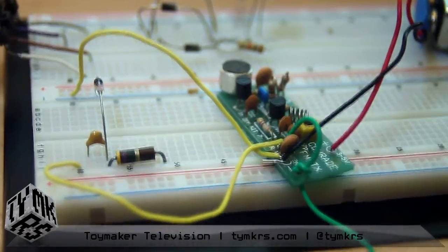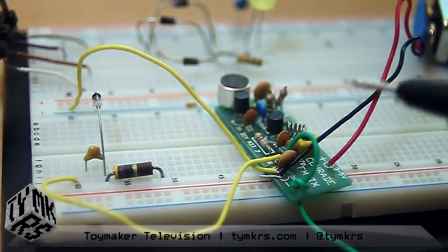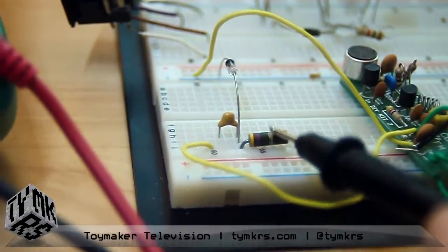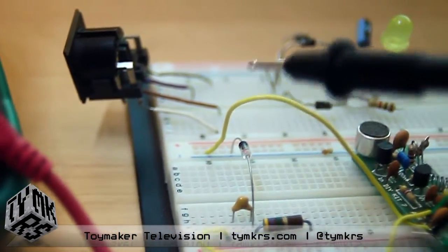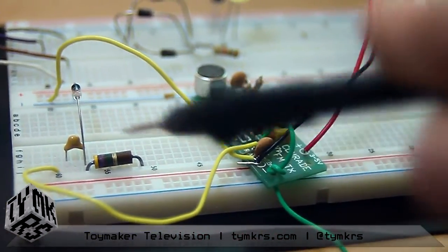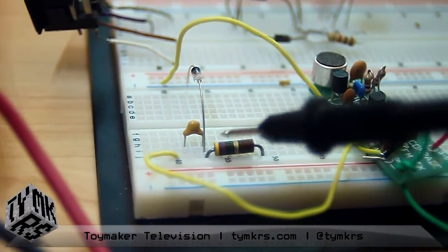This circuit board is an FM transmitter bug we were given by John S underscore AZ, attached to a nine volt battery. We have what Brainwagon called a low-pass filter: a capacitor and a resistor, and between them is a germanium diode connected to ground. From ground we go to the negative terminal on the FM transmitter bug, and the RF we're looking for is coming from the antenna going into the circuit.